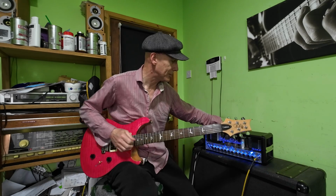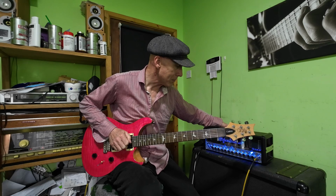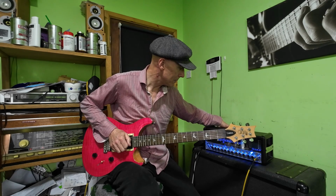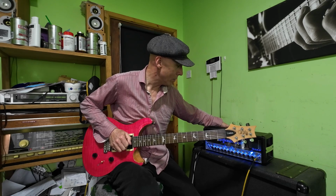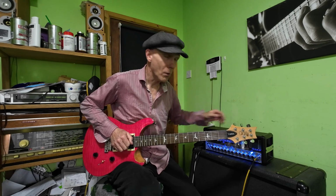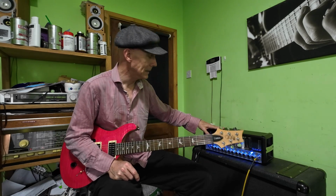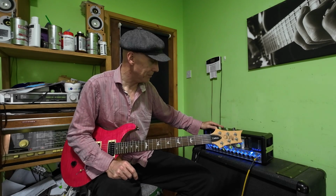So here are the settings. That's the 1 watt setting. That's the 5 watt, and that's the 18. So 1 watt and then 18 watt. That's 18 watts and 1 watt. Again, it all works fine, absolutely, and it'll work all day long like that. The protection system just shuts down that pair of tubes.